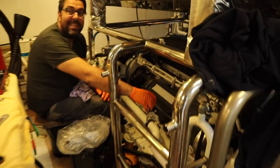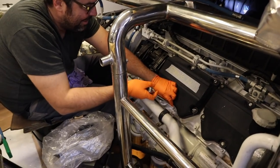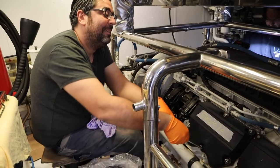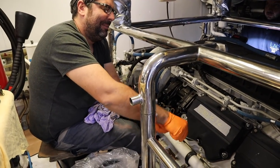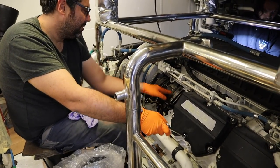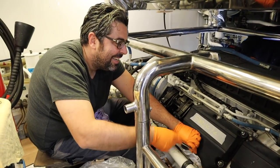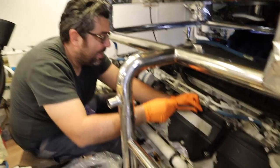We've basically got Caterpillar on board and it's Alessio doing all the work with his colleague. What's happening? We are removing the mechanism covers to remove the rocker arms and injectors for a borescopic visit. And this is all for the 10-year survey as well as our own checking.